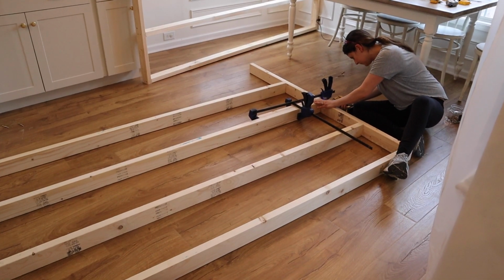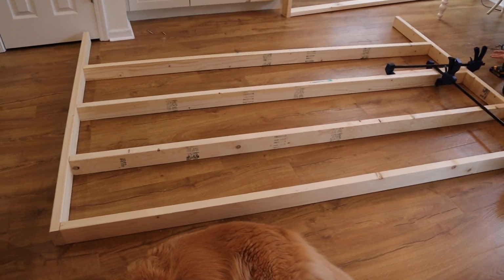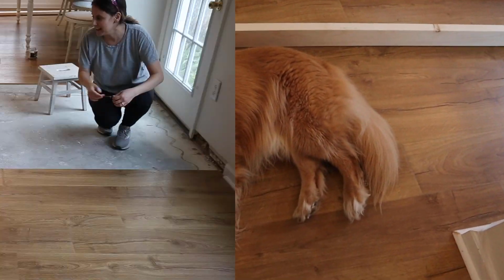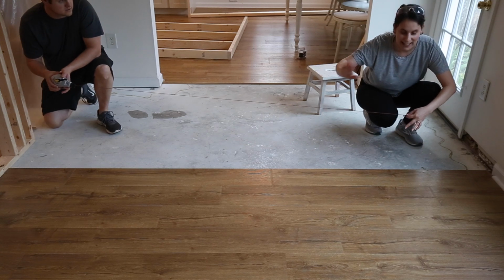So we're going to finish building those 2 walls and then we can put them in place. For our one wall that's close to our outlet though, we're going to leave the end vertical stud off because we need to still be able to get to the electric to finish that up as well as do a drywall repair over there. It's much easier to handle this wall in smaller sections. We're going to snap our chalk line to make sure everything is level.